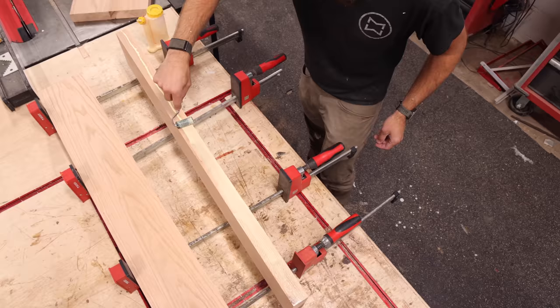Now for everybody's favorite part — I tried the samples of colored Rubio and just didn't have a brown that spoke to me, so I'm using regular Rubio on top. Final thing to do is drill some holes for the threaded inserts. I've got some bolts and threaded inserts, I'm gonna do a little countersink with a Forstner bit to hide the bolt heads — eight total, four on each side to even out the load. I've got it lined up with pencils in the gap, pushed together, and measured a bunch of times to center it. First I'll do the Forstner bit, then drill through for the actual hole.